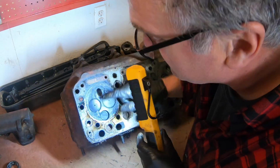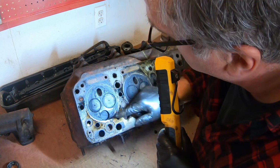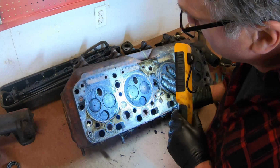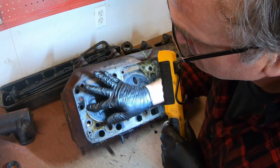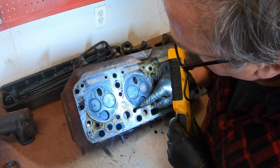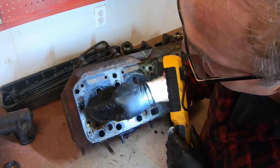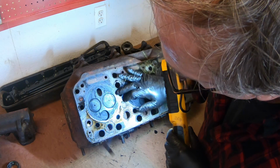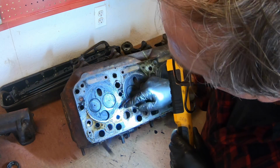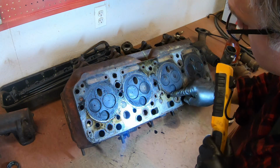You know, the valves, it's hard to tell from this end, but they're not all pitted and burnt. I'm not too worried by anything I see here, other than what a valve grind will cure as far as tightening up the valve seats and limiting blow-by. The seals around all of the cylinders where the gasket sat, there's a little bit of oil that ran onto them, but they all look intact. It wasn't leaking coolant or oil into the jackets or into the cylinders.